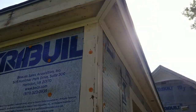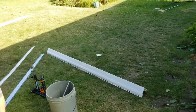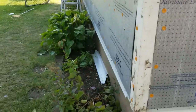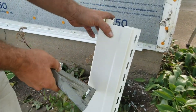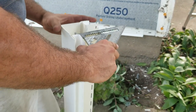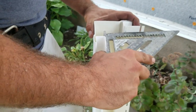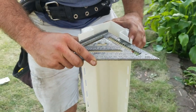We're going to show you how to do a real simple corner post. We already got it cut. I'm just going to show you a quick little trick to always make sure it's square, and it doesn't take extra long either. This is Camden Point - I always use it, so I already know the number. But once in a while, if I do sub work, they'll buy a different kind of siding and the corner post will be a little different.